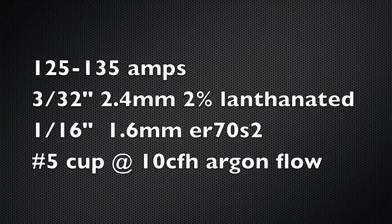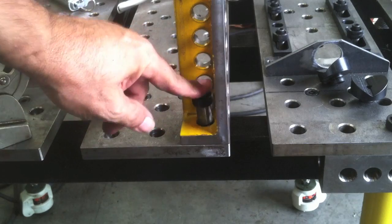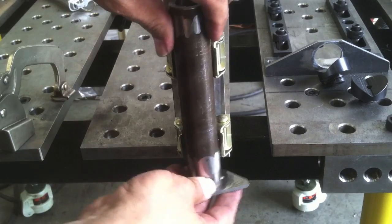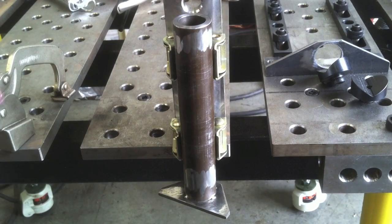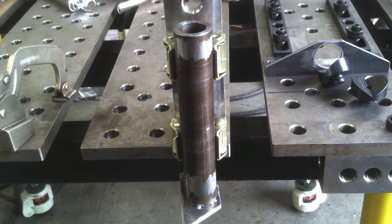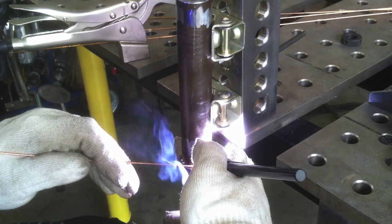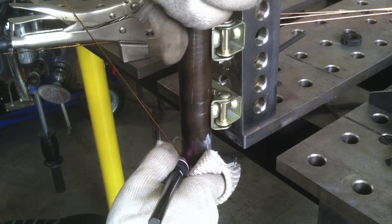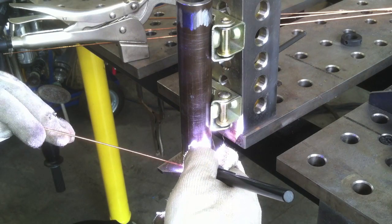I'm showing you some arc shots here — I'm leaving the rod in the puddle, and that turned out to be about the easiest way to do these parts. Looking at this now: that hot rolled — I cleaned it pretty well, but some of the areas in the pits still had some of that stuff, you can just see it boiling out. You've got to clean that hot roll really well. I used about 130 amps, 3/32 tungsten, 1/16 filler rod, number 5 cup with 10 CFH argon — rewind and pause if you miss that. Another option with the magnetic v-pads: those magnets are strong — see, that's quarter-inch wall tubing but it holds no problem. I welded a couple like this, sitting on a little stool, welded as far as I could, then stopped, spun the part a little bit, and kept going till done.